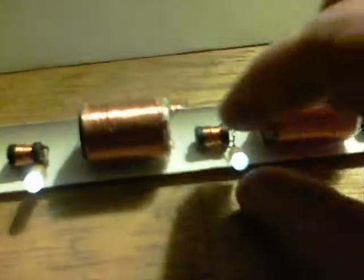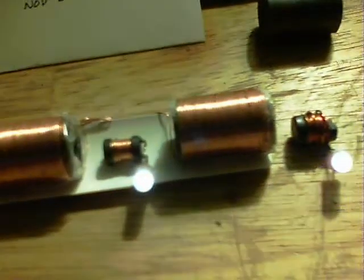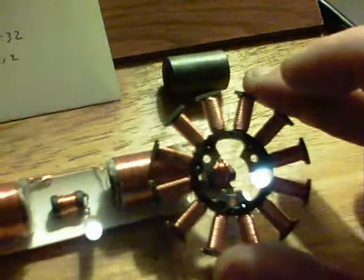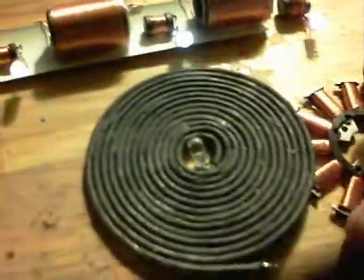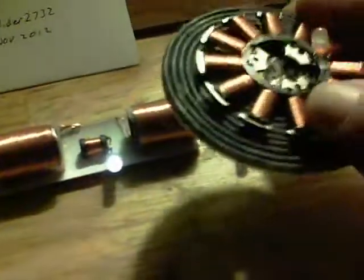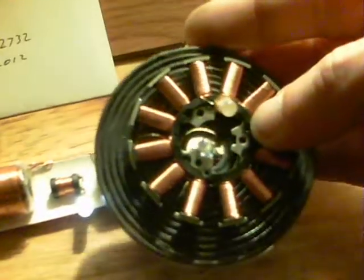As I say, these things can come out of course, but what they do is they just nicely show that the whole coil length will deliver a nice amount of wireless range. This coil here I left as it was and it works alright to pick up there — LED shining nicely enough. It came from the inside of a floppy disk drive. We've also got one of the usual tester types, a pancake coil. Interestingly, if I put one on top of the other, you may expect the top one not to receive anything, but you can see that isn't the case — both do light up. So that was an interesting little observation.